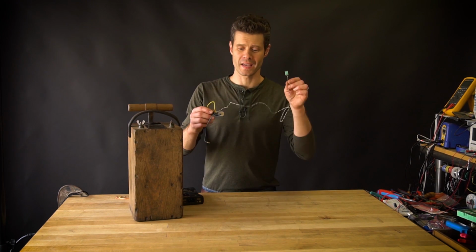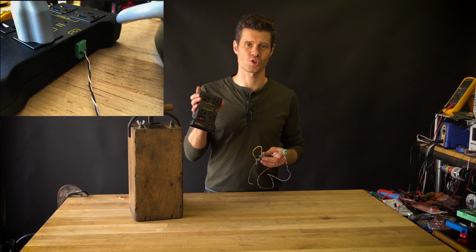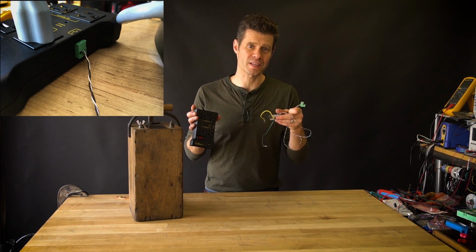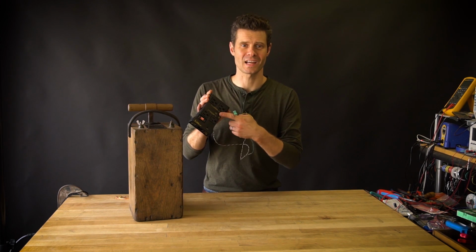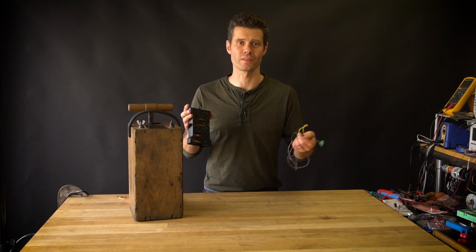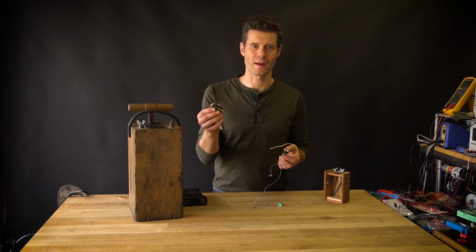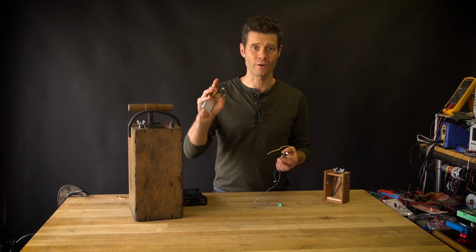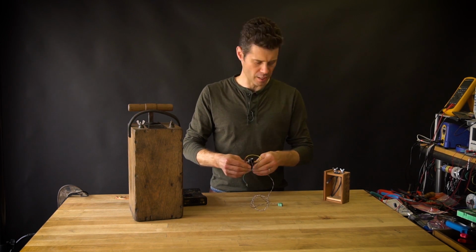I've also got a couple of wires coming off which will be plugged into the smart power strip, and the 3 volt output on this wire is enough to control the relay inside of here, which will then allow 120 volts to flow through, controlling the coffee grinder. I can plug the proto Feather wing into this Feather M0, and I've got a LiPo battery connected to it, and I'm going to put it all inside of this little wooden enclosure.